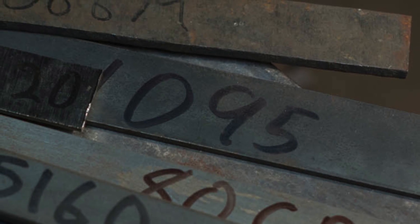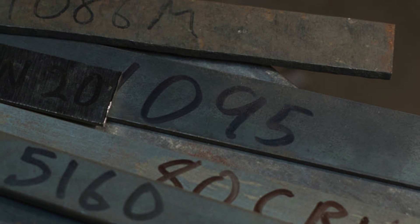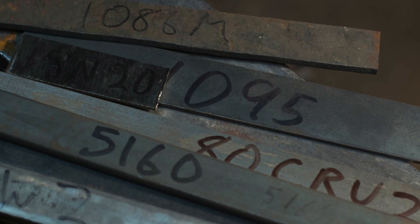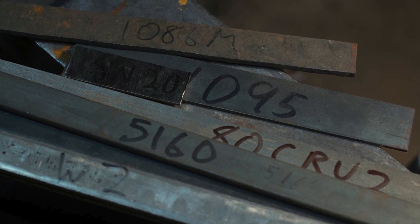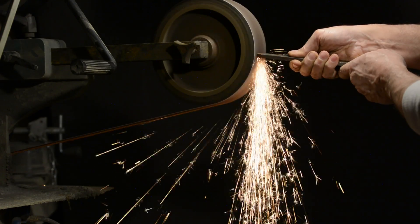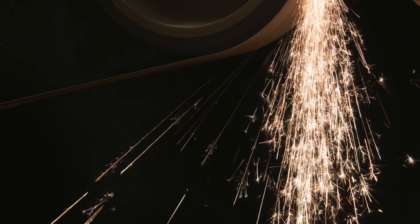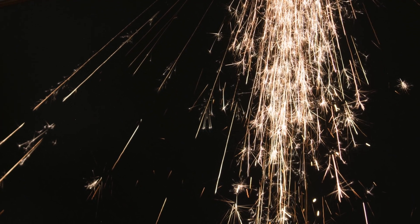Now, if you don't have professional heat treating equipment, your ideal steel will be a high carbon steel of the sort designated in the U.S. as 10-series steels: 1050, 1075, 1084, 1095, and some close cousins like W1 or W2. Basically, high carbon steels throw very sparky sparks. The spark goes flying off the grinder, and then at a certain point, each individual spark breaks into its own little ball of sparks — sort of looks like dandelions.